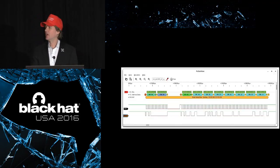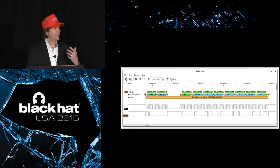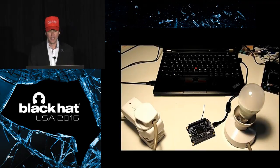And kind of the last thing I want to show you is one of the things we're working on with GreatFET, and Jared Boone made heroic efforts today to try to prepare a demo for me that I'm not going to use. Sorry, Jared. Using that fun SGPIO peripheral as a high-speed logic analyzer. So we're working on that and using GreatFET as a logic analyzer and being able to pull data into PulseView or other Sigrok tools. And we have this wonderful open source software available to us that we can interface with that lets us make a logic analyzer.